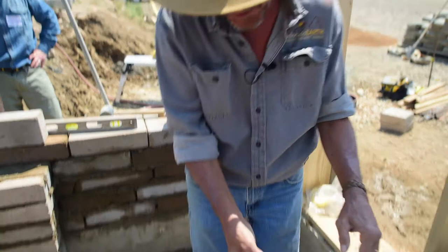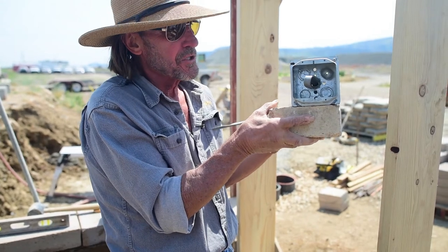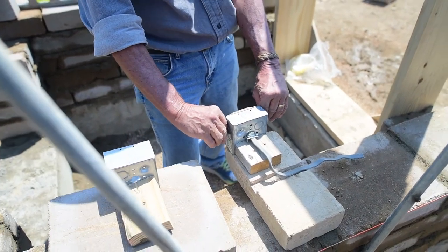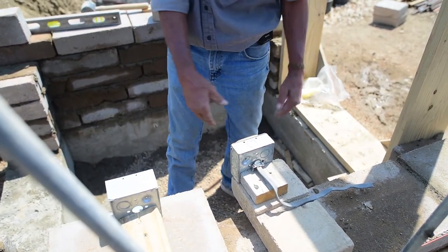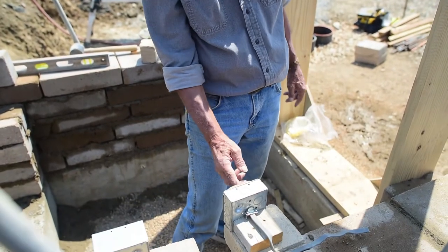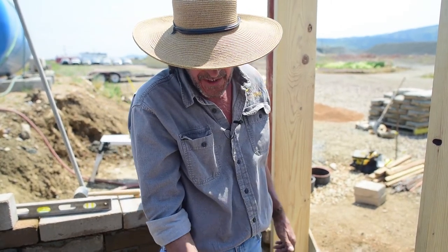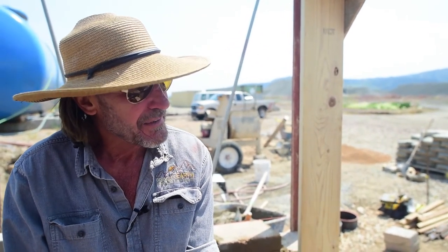Here's a plaster ring — we've got a plaster ring on this one. See it's mounted. This is for a half inch of interior plaster. So when the plasterers are working, that base coat comes out just not quite to the surface. Then when the guy puts the finish coat on, he should hear his trowel go ting, ting across that plaster ring. This makes it real easy for the electrician because he can put his receptacles right where they belong on these screws — he doesn't have to put a bunch of washers in to fur it out. Then the cover plate goes right against the wall. Everything's real crisp and clean. The box is flush to the edge of the brick — there's no guesswork.